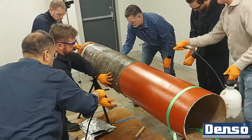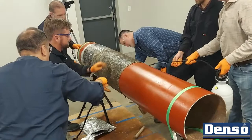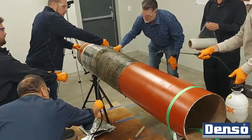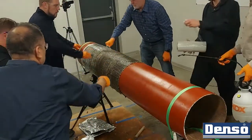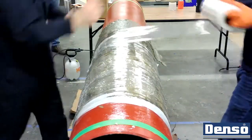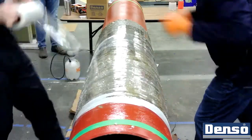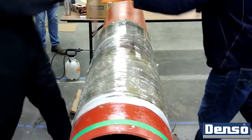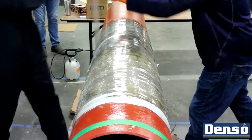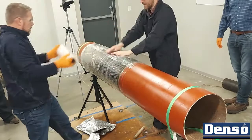This wrapping process can continue repeatedly until a stopping point is reached. Once a stopping point is reached, the final roll of bore wrap should be applied and finished with one wrap circumferentially so that it ends with fiber on top of fiber. Never leave a single layer of bore wrap hanging from the back. When finished compressing with polywrap and perforating, allow the roll to remain under compression while it cures. Resin may have escaped through the perforations, and that resin is a fair indicator of the material's dry-to-touch time.